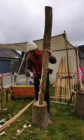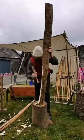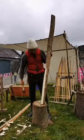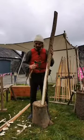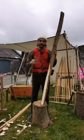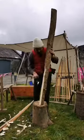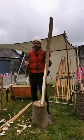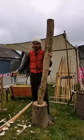Once I employ this technique of making the hatch marks, it allows the shaving to curl away and stop the axe blade binding up into the surface. I might come down below, loosen that up a bit, and then take it off. It gives a fairly rough finish because I'm not trying to be fine with it — I can go very fine with an axe, but there's another tool I might use before that: a shaving horse and a draw knife.